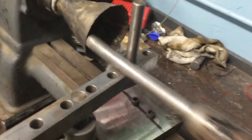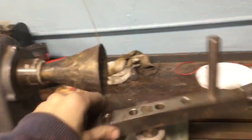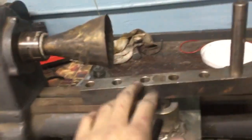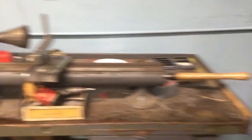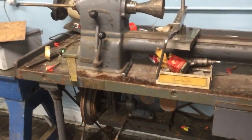So I got my spinning rest which is movable because sometimes you inside spin like this with a normal rod, and then you switch to going like this with the T-handle tool. This is movable and also you have to move the rest of the way to get the bell out. I'm gonna weld that wrench to this actually — slip slip slip slip, inside spin — and then you go like that to let the bell out. Once we're doing the T-handle, this will stay put. I'm gonna get that bell annealed and then we're gonna take a run at spinning on it.